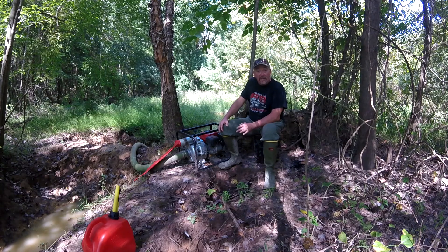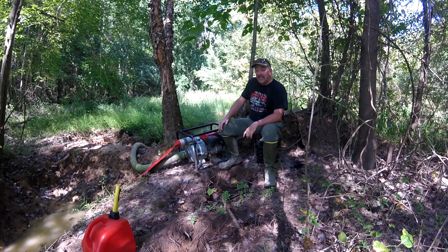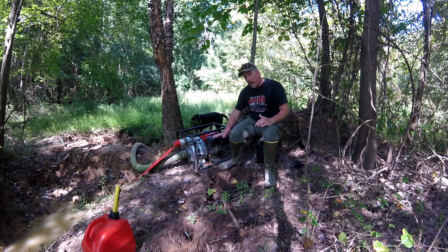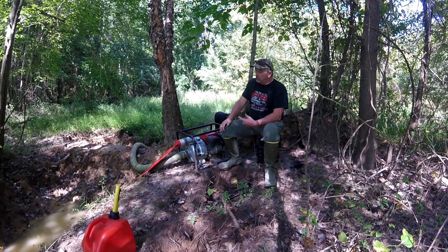So far I've been extremely happy with this — it's about as cheap as you're going to get for a trash pump, but it worked. Last year I had it out pumping another hole and a big heavy rain came through — maybe remnants of a tropical storm. It flooded out. The creek flooded. Where I'm standing right now I'd probably have had my butt wet, about a foot deep. It almost completely submerged the pump. I pulled it out, didn't even take the spark plug out, just pulled it over a couple times to make sure it wasn't hydraulic on me, put some gas in it, pulled the crank, and it powered right back up. It's run fine ever since.